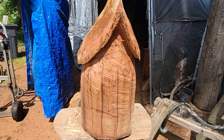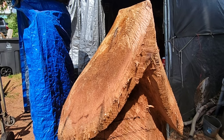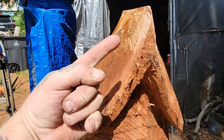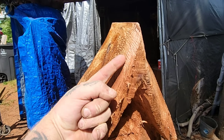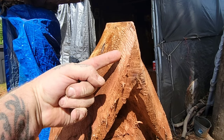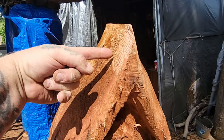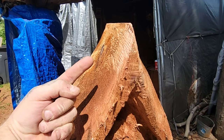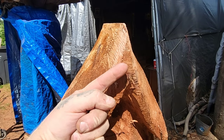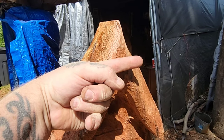So I'm going to do a close-up because I'm going to do a plunge cut that I'm going to do here and try to cut all the way through. Pretend this is the bar and this is the wood. You start at an angle, you cut in the bottom, and then once you're in there, then you bring it up, then you can cut through, okay? So don't just start this way because you can get kickback. So start on a bottom angle, cut it through like this, the tip, straighten it out, then cut through.